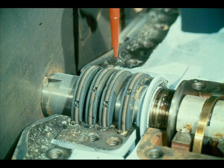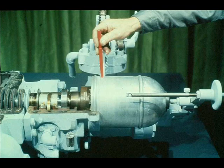By removing the packing housing, you can see how the packing rings are spaced on the shaft. These are carbon packing rings — three-piece rings which are held together by garter springs. You'll have a chance to look closer at these rings in a few minutes. This hood over the outboard end of the turbine shaft encloses the constant speed governor.